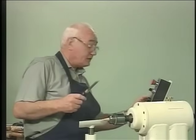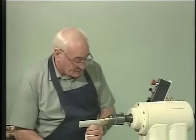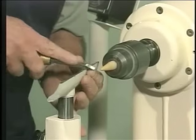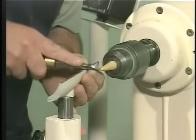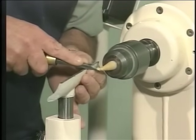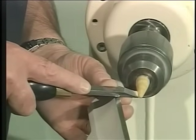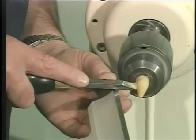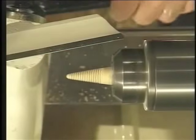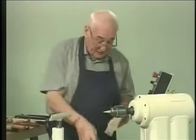Thread chasing speed of, again, approximately 300 RPM. Just setting the rest so it's at the right height for the chaser. A little bit higher because I want to be trailing slightly down. That's it there. And now I just chase a 16 thread up here now. And that's fine. We've actually got a clean thread run up there. And now the purpose of that thread, as you'll see, we'll locate our mop